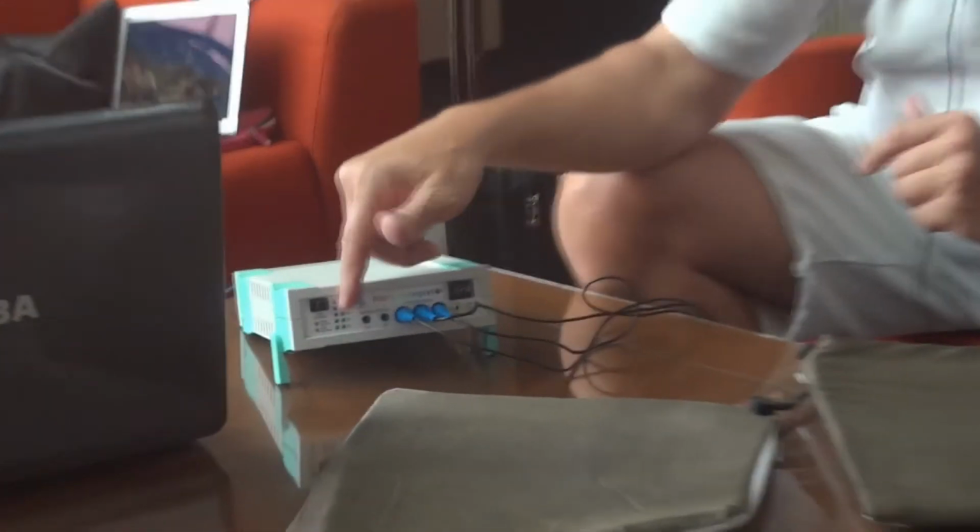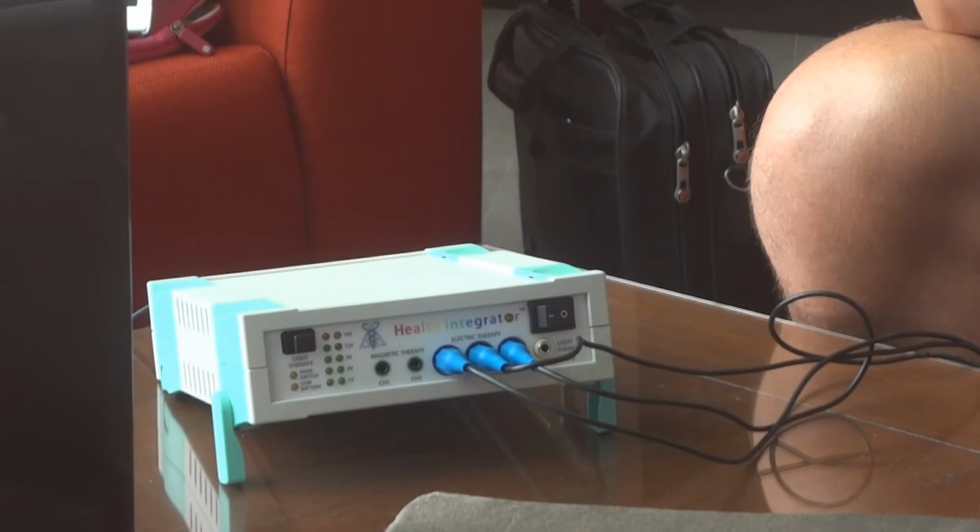And to adjust the amplitude, you have to adjust the volume. That's as simple as this. On your MP3 player, on your computer, go to the loudspeaker tab, and there is a way to adjust both of them. If you have the core software connected to it, when you scan for resonance, it will even suggest the relative amplitude between the 2 channels, and it will adjust them automatically correctly. But the total amplitude you always have to set with the loudspeaker, and you'll see it here.